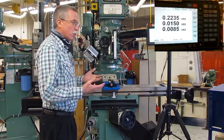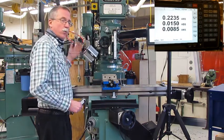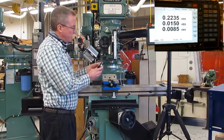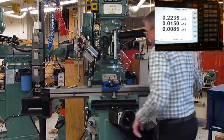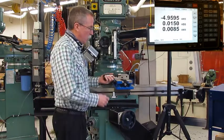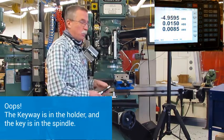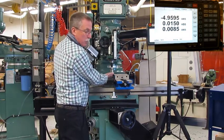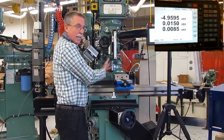So if we're going to insert a tool, I'm going to select a tool holder. I'm going to reach over here and grab one of our tools. For all our machines, we always go to the left to grab our tools and our tooling. In this case, I'm going to use this, which is an end mill holder — and this end mill holder is for a three-quarter inch shanked end mill. I'm going to move my table out of the way a little bit so that I can insert my tool holder into the spindle. You'll notice that there's a key right here where my thumb is. That key has to line up with the keyway in the machine. I'm going to hold my hand underneath my end mill holder, slide it up into the spindle, and slowly turn while applying gentle pressure upwards. All of a sudden it will just take off, which means I've met the key. The key is now engaged in the slot.